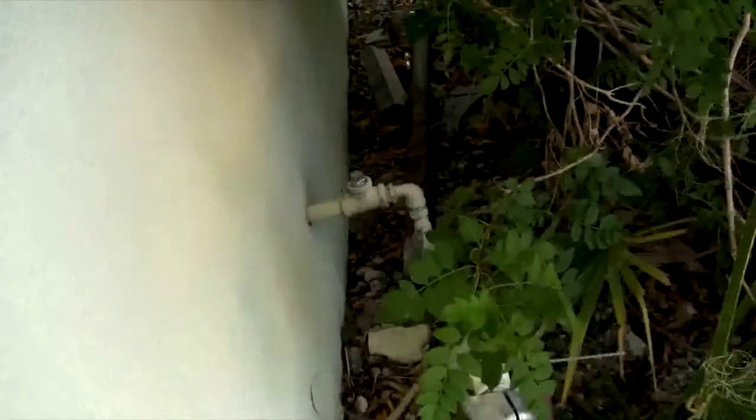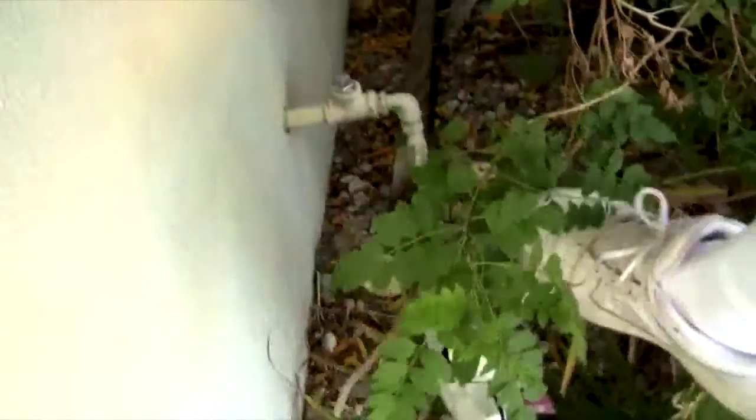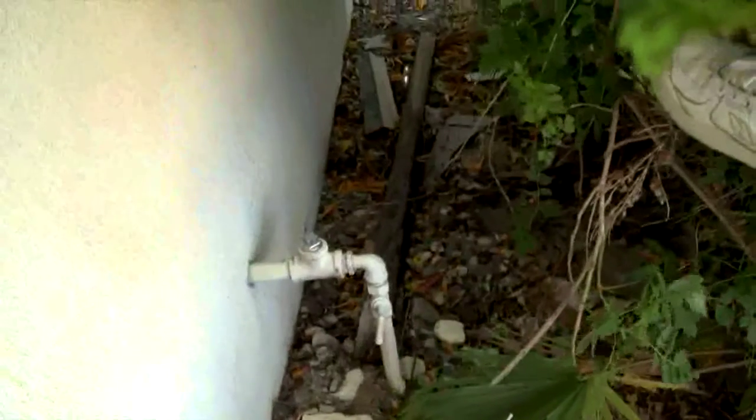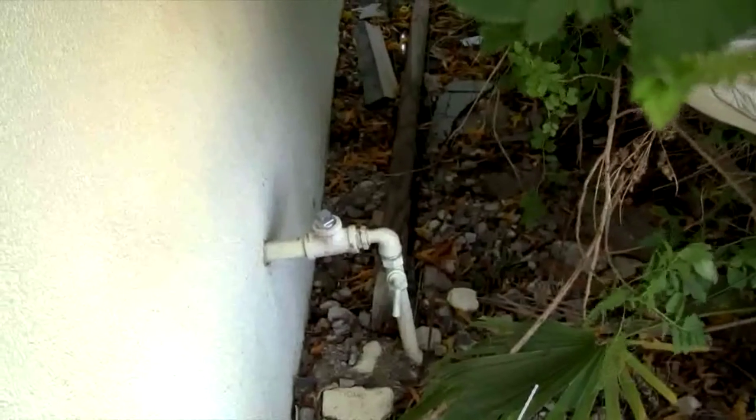Going to take it up to the other house and see if it works. Over here you can see the underground pipe from the gas company — it's been disconnected and capped. Here's the gas pipe for the service for the dwelling. The objective is to keep this gas service and replace it with fresh new pipe and new joints. After it's all installed, we need to get a good pressure test.